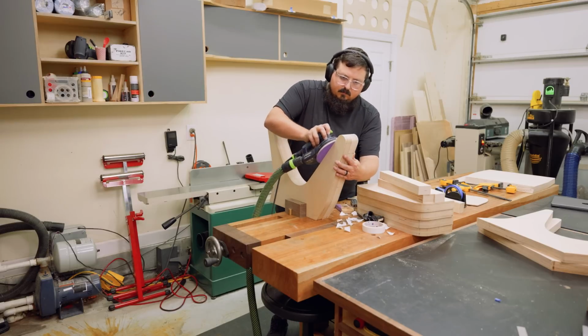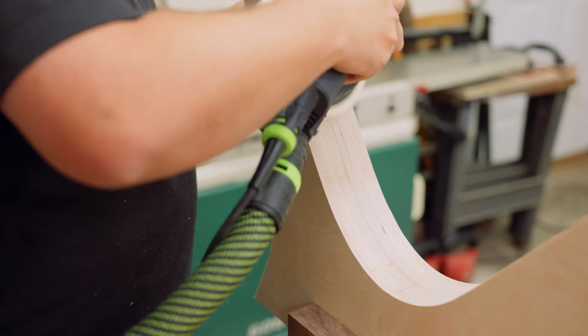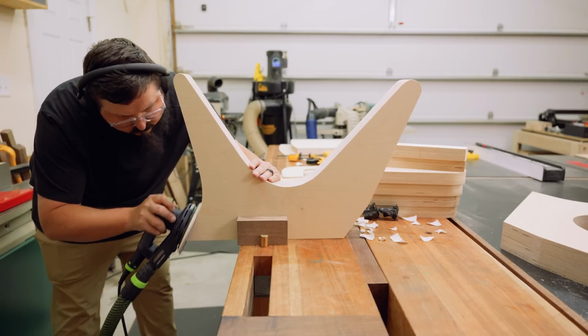Since a lot of my parts are stuck together like Matt Damon and Greg Kinnear, I felt like it was a good idea to go ahead and sand the edges. This gives me a lot more surface area to keep things flat and reduces the amount the edges will get rounded over in the process.